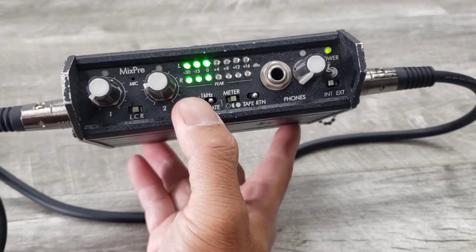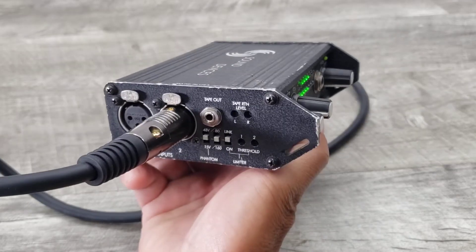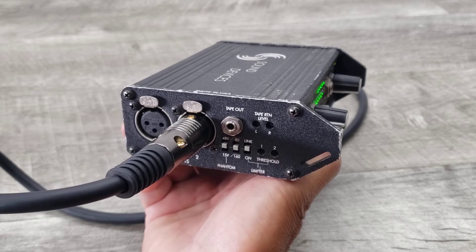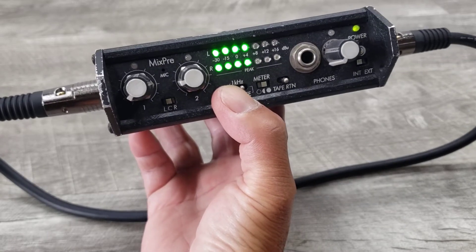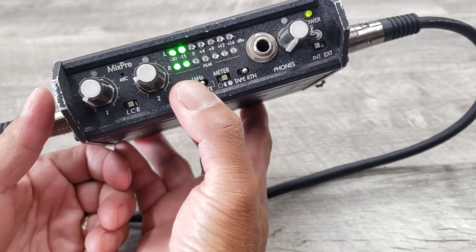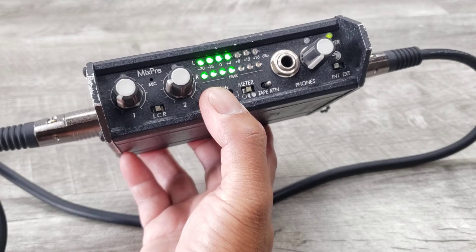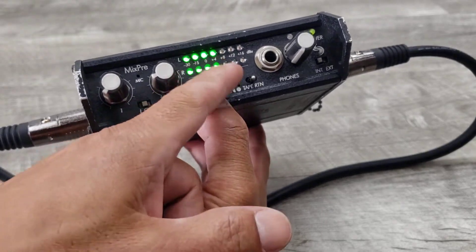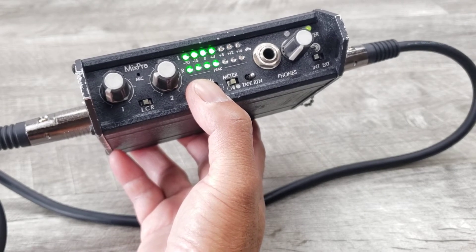Basically that's a quick demo of this unit. A few things about it: it features a 66 dB gain max, it's got a high-pass filter. The audio performance as far as specs goes is 110 dB. The bandwidth is 10 to 50 kilohertz, very low distortion, and it's got a six-transistor balanced output. It's also got level metering and a feature called an unclippable input peak limiter.